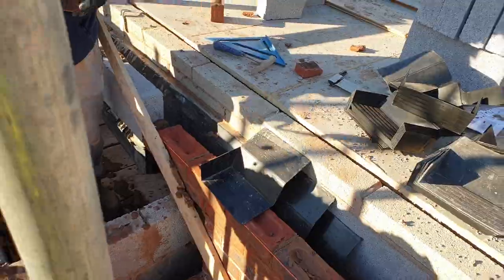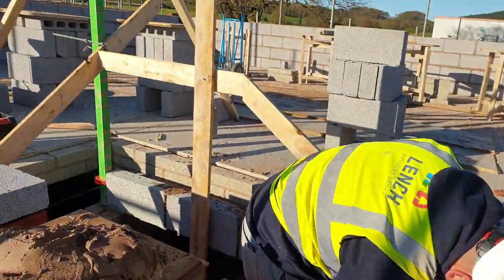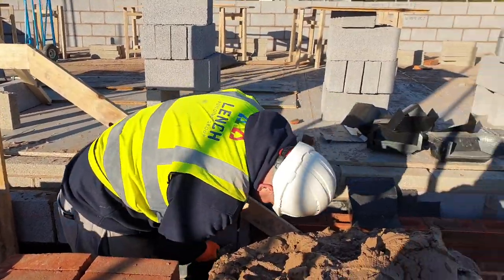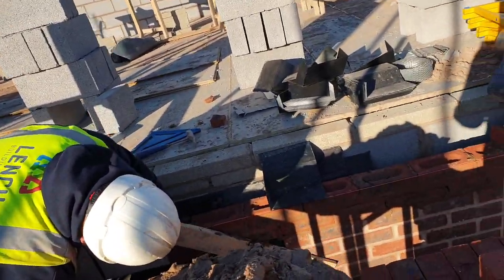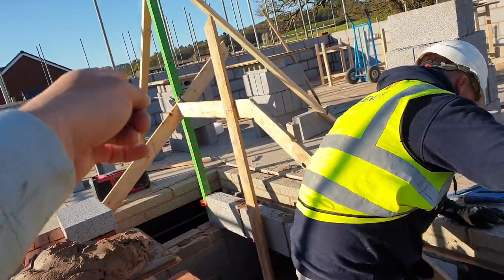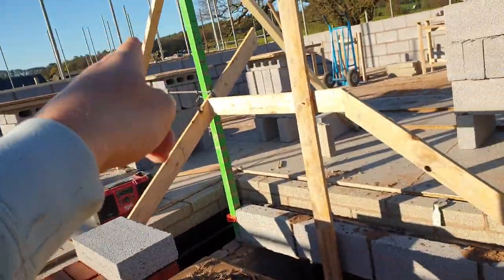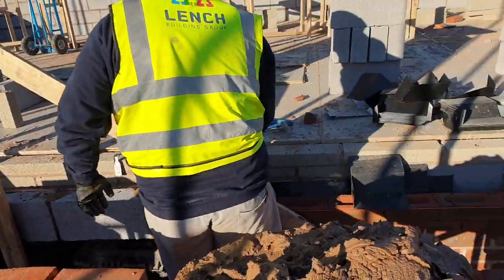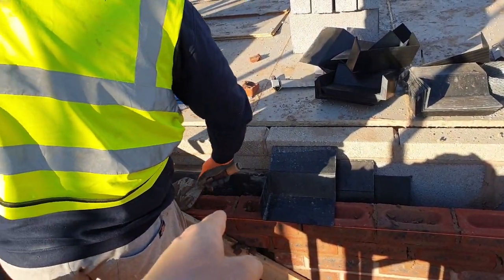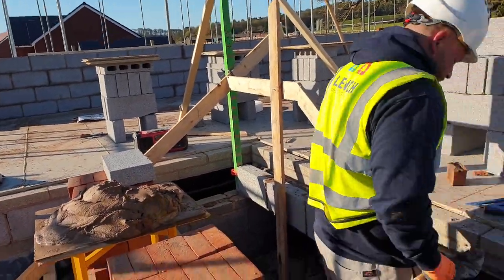And that's how you do pre-formed trays when you're doing anything like this that's got a roof line. That is the best way to do it — get it set up like this. So if any of you out there, brick layers, are trying to guess by putting a dummy rafter up against it yourself — which a lot of people do because you don't get your rafters made up like this — make sure that you get the joiner over and put this in place.